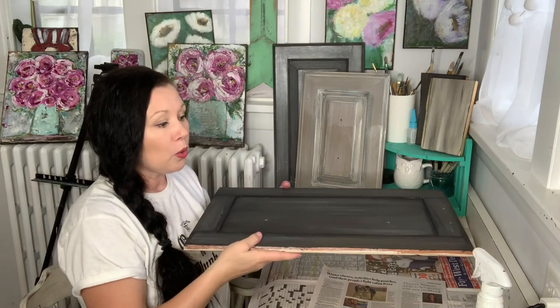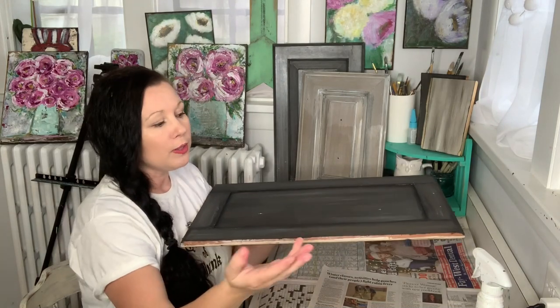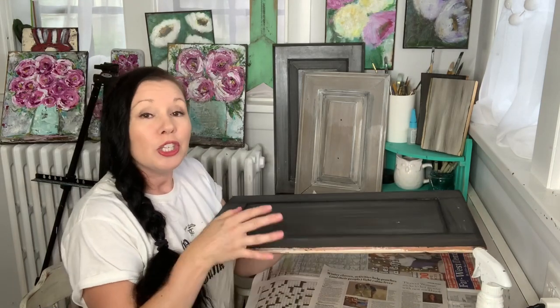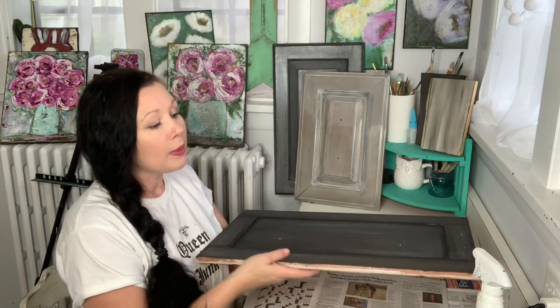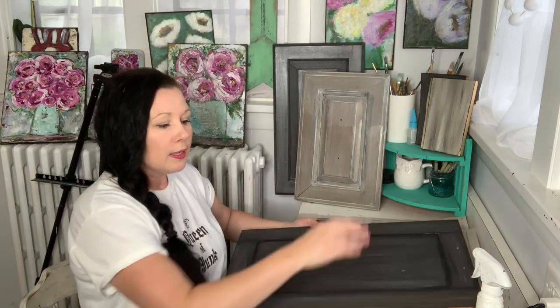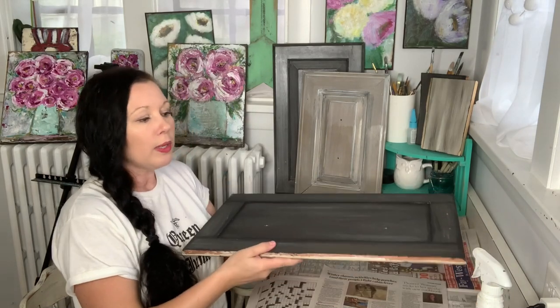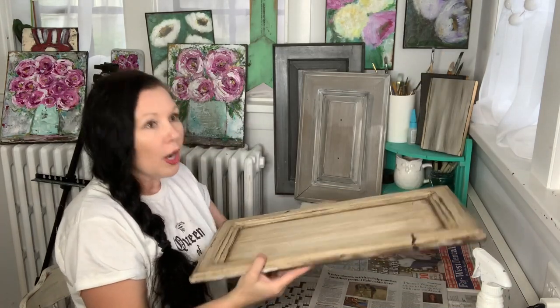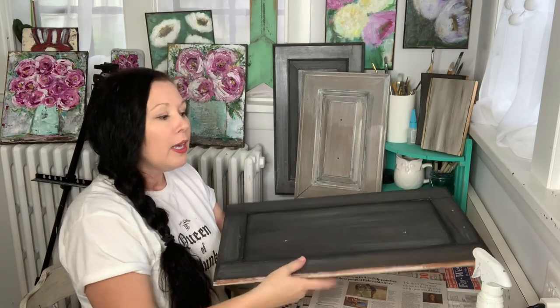When you have your kitchen cabinet doors all laid out, find a surface and put some wooden planks underneath. If you were to paint right on top of newspaper, chances are it would stick and you'd hate yourself later. Put it on some wooden planks — something it can rest on — because you're going to paint one side and then when it dries, flip it to the other side. When I paint kitchens, I do not paint the inside of the cabinets — the space where you hold dishes and glasses — because there's a lot of pushing and pulling and you don't want your paint job scratched up. Nobody sees it anyway.